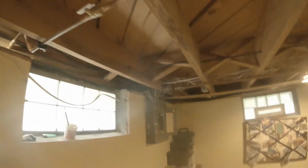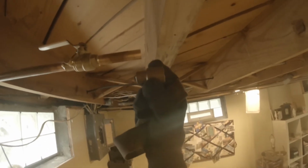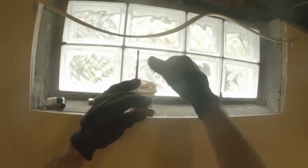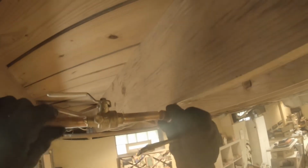Okay, so yeah, that's all I have left of the 1/2-inch copper, so unless I want to go out to the truck, I'm just going to put this 1/2-inch to 3/4 inch reducing coupling on there, and sand that again because I probably got my fingerprints on it playing around, taking it apart and messing with it. Okay, I already sanded this and fluxed it. So there we go. Now we just start running 3/4 inch over there.